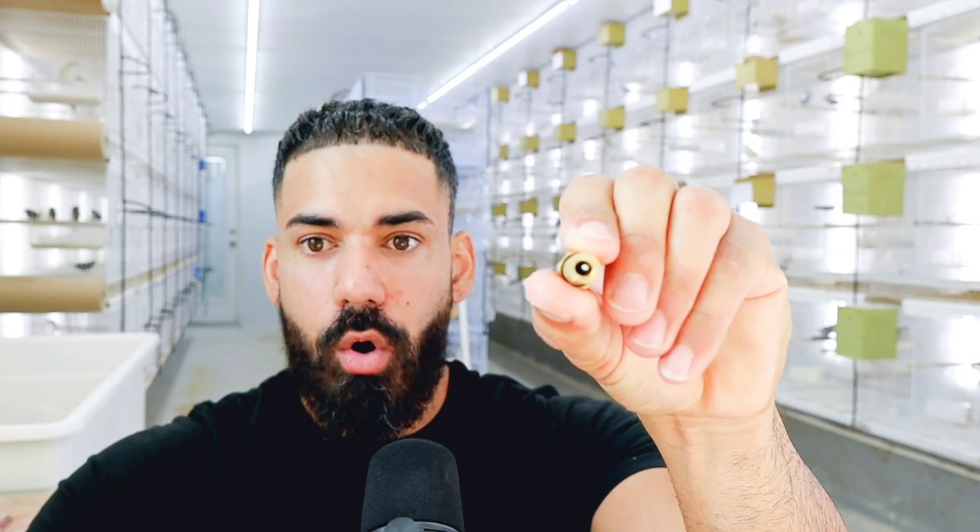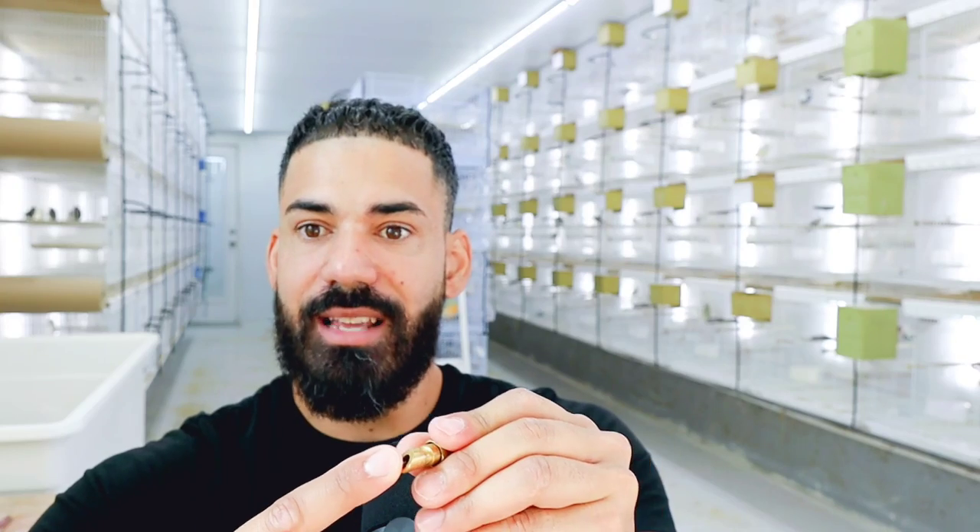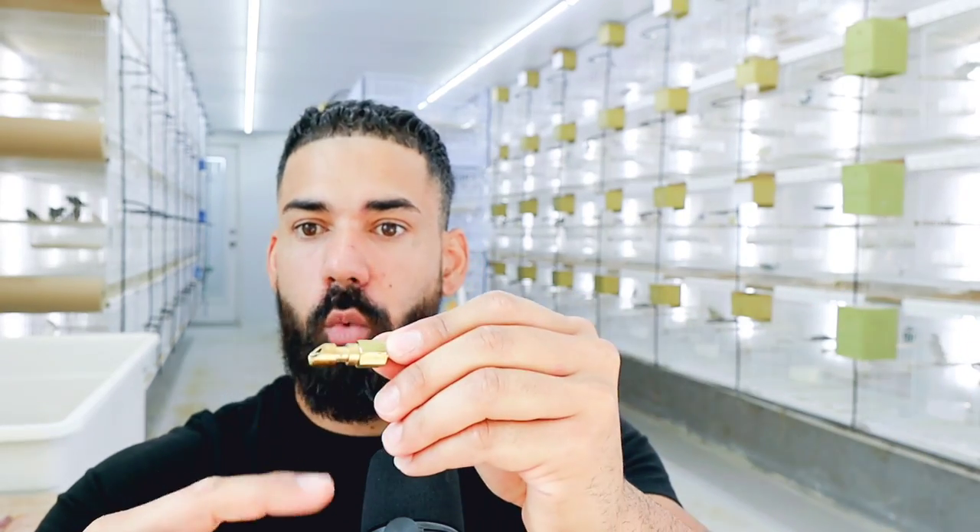The only other issue I've had over time with these valves is that some of these birds like to wet their seeds. They'll grab a seed, come up to the valve, and stick a seed inside that little hole because they want to wet it to soften it up. What happens is sometimes the seed gets stuck in there — it presses that little plunger to the side and I come in in the morning and there's water just dripping from these things, with a small puddle on the floor. It's nothing big but it is a headache — it's something you have to watch out for. You have to inspect these every single day. I just take a look to make sure that none of them are leaking or causing puddles. But that is very minimal compared to what I would have to do before filling up water containers.